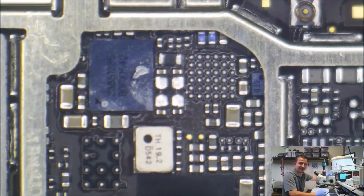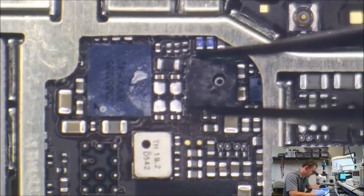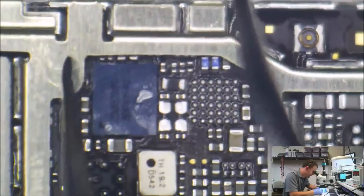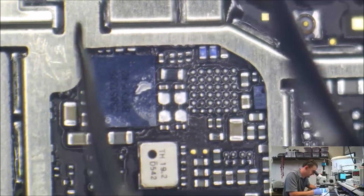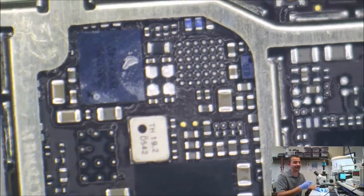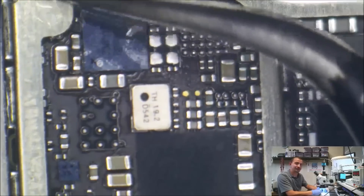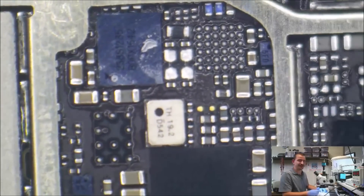It's moving — and away we go, heats off. I almost made a critical mistake — I forgot to take note of the orientation. I always put a little arrow somewhere, even on jobs I've been through a bunch of times, except for touch IC repairs. I can see the arrow amongst the scratches. This is also a previous repair attempt — somebody else attempted board-level work, shields have been unsoldered and soldered back on. I can tell the orientation of that chip, so I'm going to open the shop and come back.